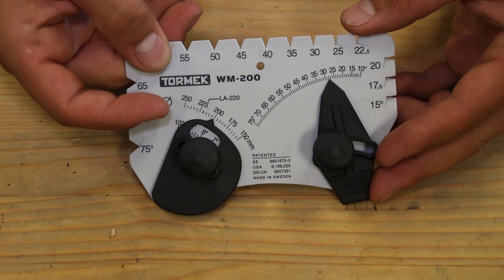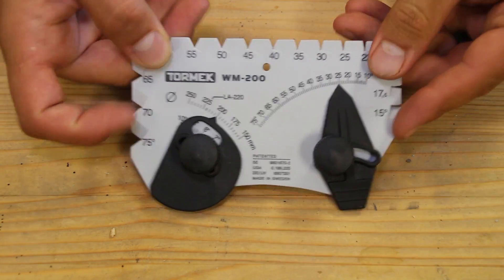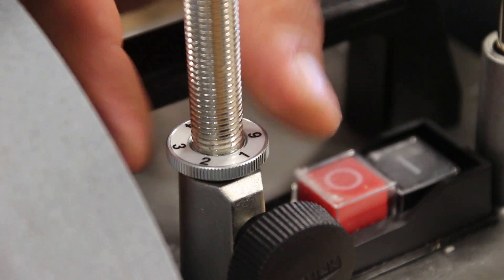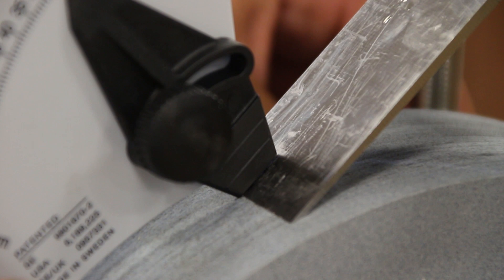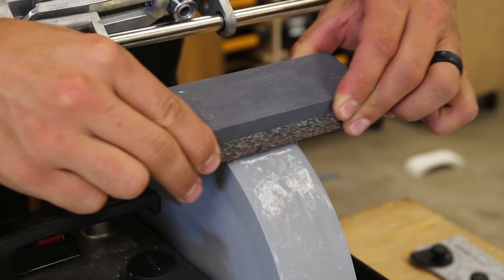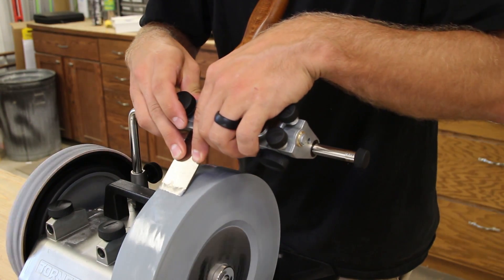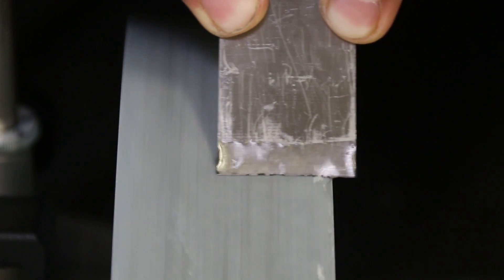Remove the safety knob from the jig and install on the end of the tool rest — this will keep you from going too far. Next, we need to set our angle master 200. The left angle is for the size of the wheel and the right angle is the grind angle we want on our tool. Place the angle master on the base of the chisel with the corner resting on the grindstone. Using the adjustment knob on the tool rest, fine tune the angle so there's no gap between the angle master and the chisel. Grab the dressing stone and apply moderate pressure using the coarse side. Make contact with the grindstone and slowly move back and forth — we want to wear the grindstone evenly and not favor one spot or another.